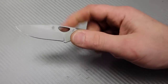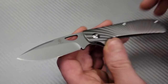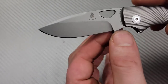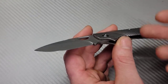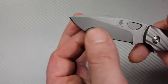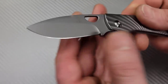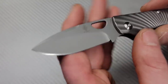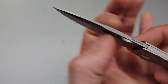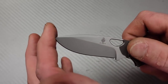The close is super easy too — it goes a little bit past halfway so it's very easy to manage. Opening and closing is very very easy. The blade is more robust than the rest at about 20 thousandths behind the edge, and yes I'd prefer a hollow grind or thinner grind, but with what you're doing with this knife it's not going to hold you back too much. If you work with it a little more, just lay back the edge angle a bit and it'll be fine. The spine is not too thick — medium range — with a nice robust tip.